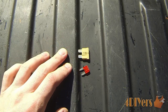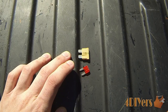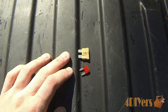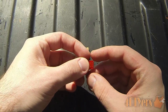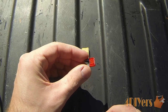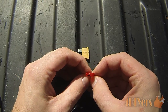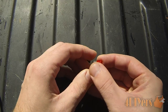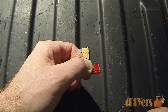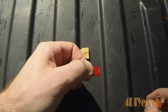Another option is to do a visual inspection of the fuse itself, though you can't always see when it's broken on the inside — similar to a light bulb where the filament has a small hairline break you can't see visually but the bulb doesn't work. The plastic housing is somewhat transparent so you can sometimes see through the top or from the side. Holding the fuse up to light, you can see the U-shaped connection inside. When it burns out you can see a break in the casing or in that connection.